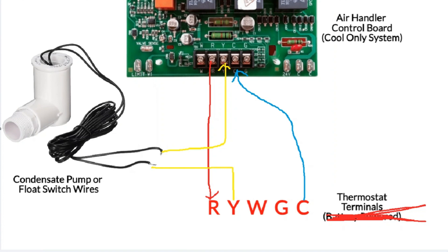This is also a preferred method if you live somewhere like Arizona, where you might be using heating and cooling at certain times within the same 24-hour period. For example, if it's warm enough in the day to run your air conditioning but cool enough at night to use a little heat, this is also the most ideal way to wire these switches in — whether you have a smart thermostat or not. The reason is we will still be able to run heating off this arrangement even if cooling can't run due to a water problem, whereas killing the 24 volts to the thermostat would disable both heating and cooling even though heating doesn't generate any water.